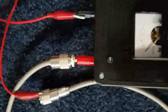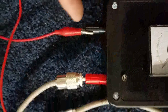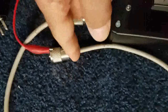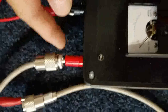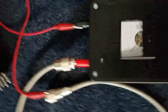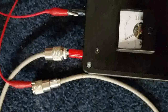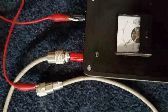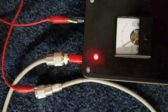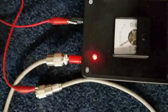Here's a piece of coax that appeared. I have the positive lead hooked to the shield by clipping it on the shell, and I just poked the center conductor of the UHF connector — this is some old cable I found underneath the bench. I'll run the voltage up and see how the cable does. There's two and a half thousand volts from center pin to shield. Around two and a half kV it breaks down.